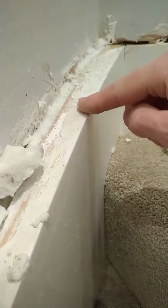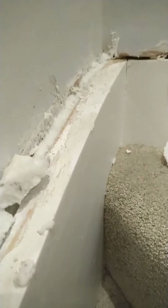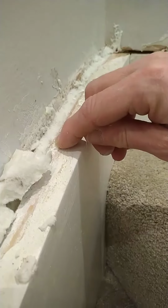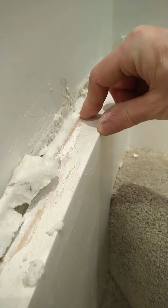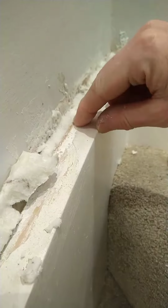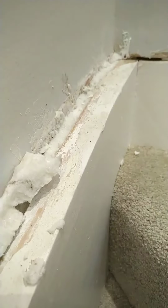This doesn't have to be a complete right angle. It can be slightly beveled. Nobody will ever notice. And I'd rather have that than have that potential line there cracking back open again. Because even with this squishy foam in here, this expanding foam and resin, which is the best way to solve this because the carpentry is shocking, it is still liable to have a little hairline crack along there. So it's better to bevel it right the way across.